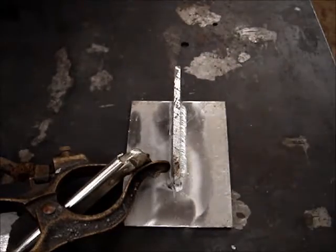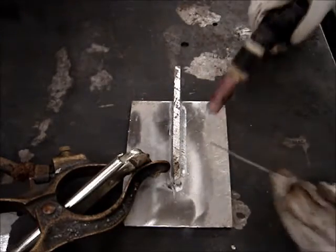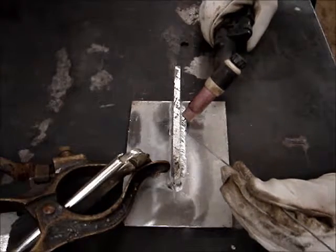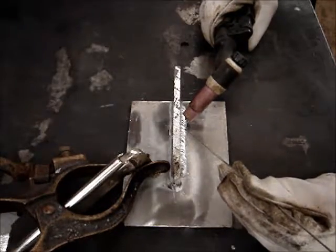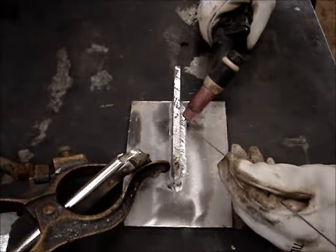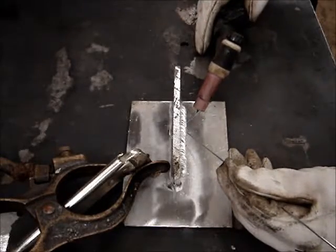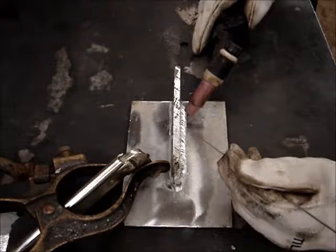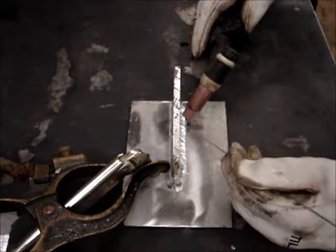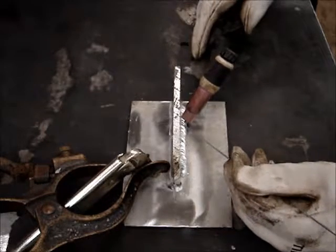So basically, when you have your welding machine here and you're leaning up against it and you're going to fill in there with the wire, you're holding this nice and steady, real close. Obviously, like I've said before, you don't want to dip your tungsten. So you're down in here like this and you're real close with your face, watching that. Obviously, my thumb would be on this control right here, and I'd be controlling the amperage with my thumb as I'm moving along here, and you go in and you dip and you move, and you dip and you move.